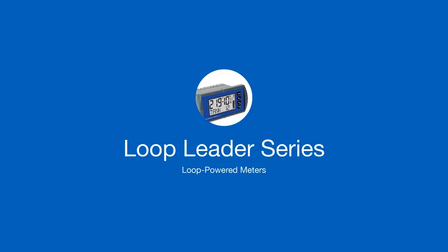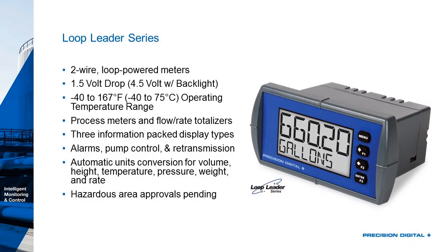So the first thing we're going to look at is our new Loop Leader series, Loop Power Meters. And those of you familiar with the existing Loop Leader products will notice that these do look very different. So what are these new panel meters? Well, they are 2-wire loop power meters. That means they get all of the power they need to run off the 4 to 20 milliamp, which is what they're also reading.